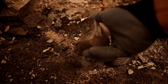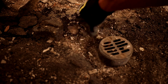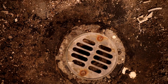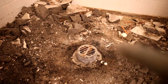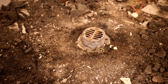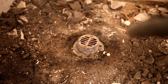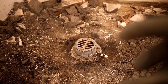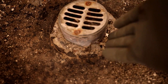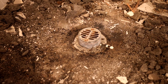I don't see any weep protection at all — no gravel around the weep holes. Nothing. I don't even see any weep holes in this drain, at least none that are open. And that's the main problem. I have yet to tear out one of these hot mop cast iron drains that we use up here in Northern California and see them working functionally. If you're going to use these systems, you need lots of weep protection — either gravel, crushed tile, or spacers — something to allow the water to weep down into those weep holes. Also clear out those weep holes really well. These drains in general just aren't good — they always get clogged up.